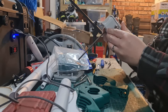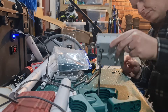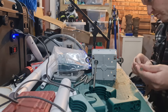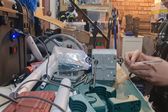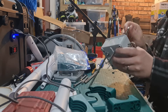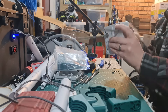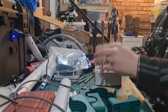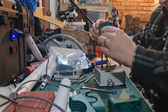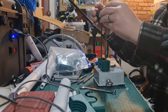At the top of the mast, I actually need a way to terminate the open wire feeder. So I'm just using a project box here, with jumper wires going through it. These are stainless steel M6 threaded rods that I've just cut to size. I've used all stainless steel hardware on this — stainless steel eye bolts. I've used an extra pair of tube clamps, just so it stands a bit further away from the mast.